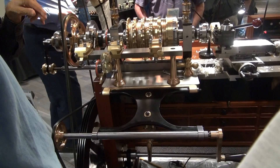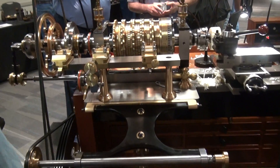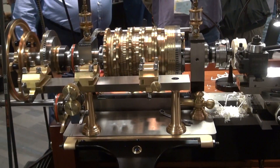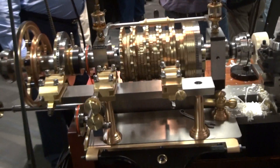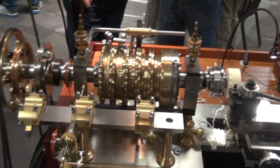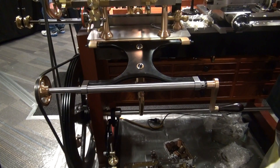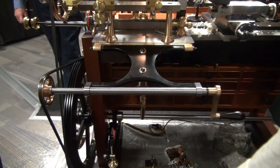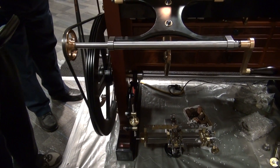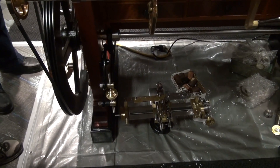Do you have a vertical point towards the center on both sides? Not necessarily the center, because what you're seeing is on the outside edge. So I'll go in and hand-crank it across, and just let it mill that shape. Then when I index it and cut it, it's the same all the way around — I'm not cutting that corner. If you go a little deeper, it gets a little wider and you can close those gaps. I was doing 96s, but they were too small, so I went to 72 circles. I like that better.